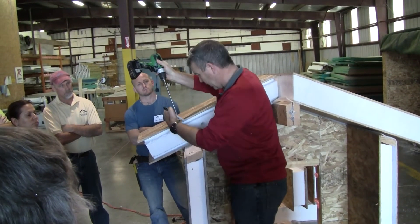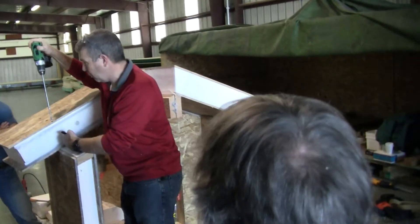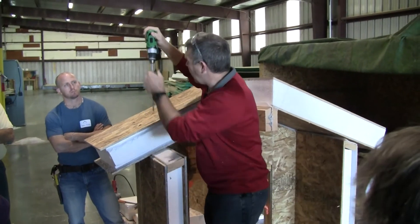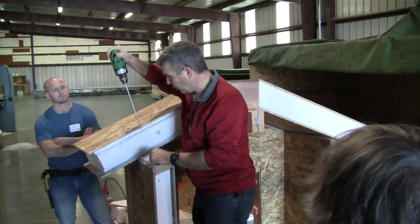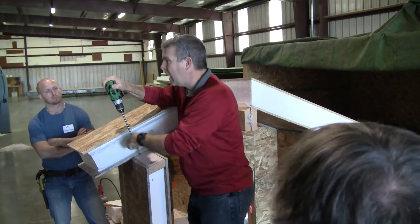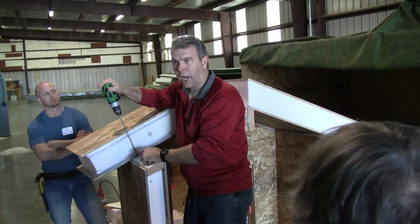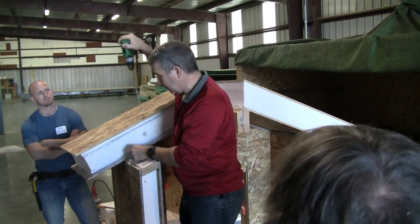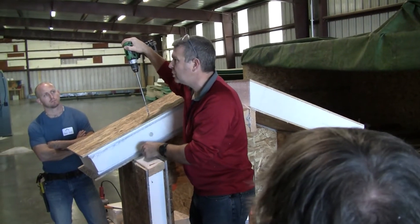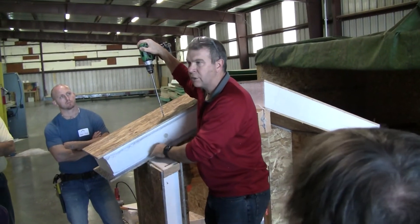When you drill the hole that goes down above the eave or above the supporting wall below, that's why we use a drill bit this long — because I want to drill all the way through the entire roof panel, right down into the wall. Then when we inject the foam at that corner, we're going to give it an extra-long shot, and what we're trying to do is seal between these two skins and on the bottom of the spine that goes in this location.